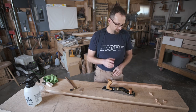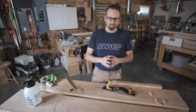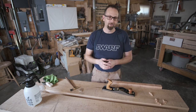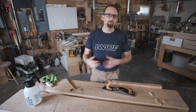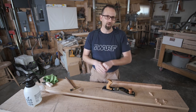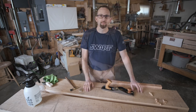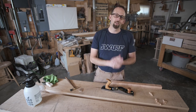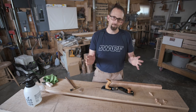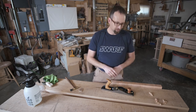One thing I've learned about myself is that when I sharpen, I tend to lean a little more on one side than the other, and my blades slowly start to move out of square if I don't check them. Now I have a habit — if I'm sharpening a blade multiple times during the day, every once in a while I'll put a square on it before I sharpen to make sure I don't need to adjust the angle and pressure. If it's something I haven't used in a while, I always check it first. So that is the setup and sharpening process for every low-angle bench plane — applies to a smoother, a jack, a jointer, anything in between. Remember: only use the ruler trick on planes, not on chisels. Enjoy your time at the bench.